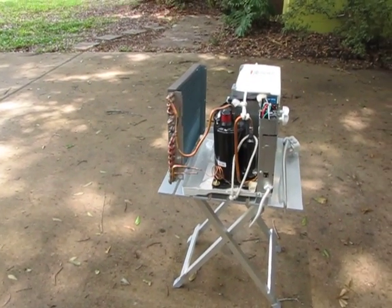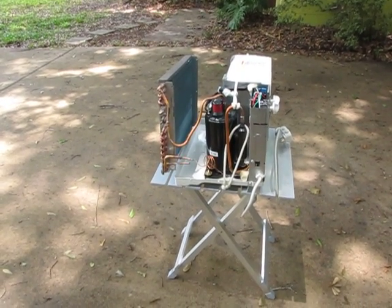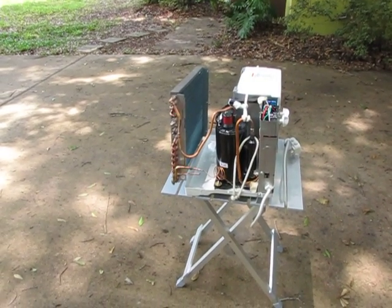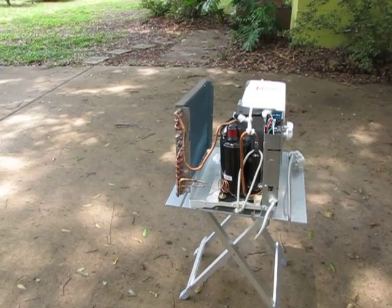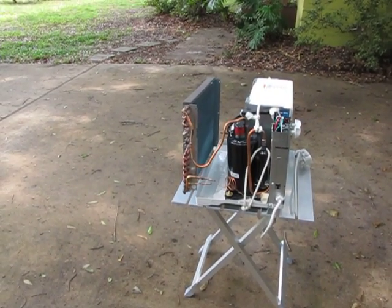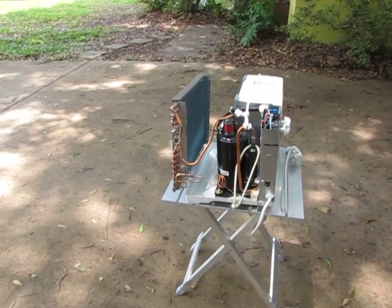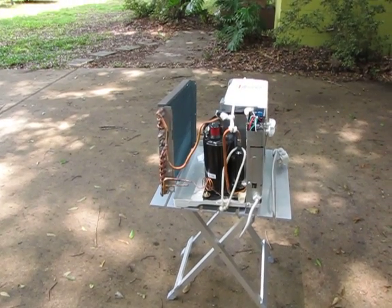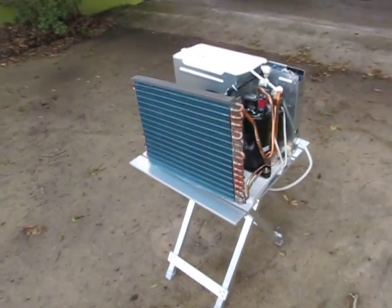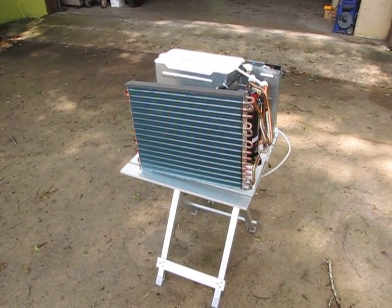Why am I doing this? I'm going to use all the heat that is normally just blown by the fan motor through the condenser coil into the outside air. Instead, I'm going to immerse this condenser coil into some liquid — first just water to test things. So at the same time the AC is removing heat from the air inside my trailer, it will also be saving that heat and using it to heat water. The whole unit will sit inside the trailer with no need to communicate with the outside air, since the condenser coil will be immersed in water or some other fluid to store the heat.